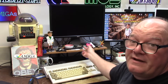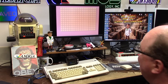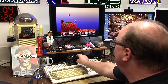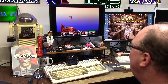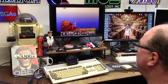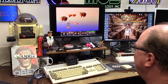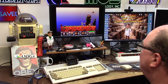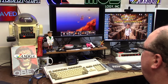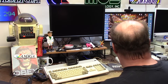I'm going to load Turrican AGA off of ADF to test the chip speed of the PiStorm using my dev TV — I'll unplug its power so it doesn't squeal. What I'm looking for is artifacting on AGA screens — you'll see silver artifacts. So far so good — no artifacting, no slowdown. The chip RAM is just a number. So far no issues — this game was horrible before and now there's no slowdown. They must have fixed the chip RAM issue.